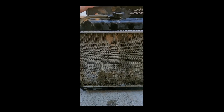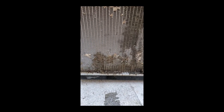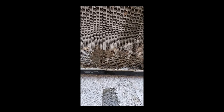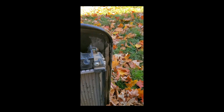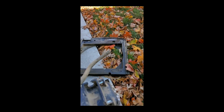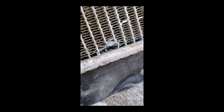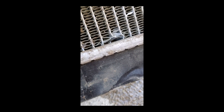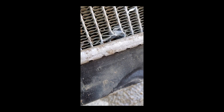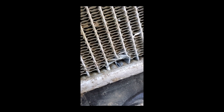Here's my old unit. As you can see, it's kind of dirty. This is obviously already out of the tractor — I've cleaned it up a little bit to try to see what happened and why we had a leak. This unit is usually all put together in one piece with some mounting bolts. I've since taken it apart, and this back shielding that goes around the fan — I've got it separated and found my culprit. On the backside of the radiator, there was damage done to some of the fins. I'm not really sure how — I don't know if it internally busted or something somehow got in there from the back. I poured some water into the radiator and it was flowing out of that spot right there.